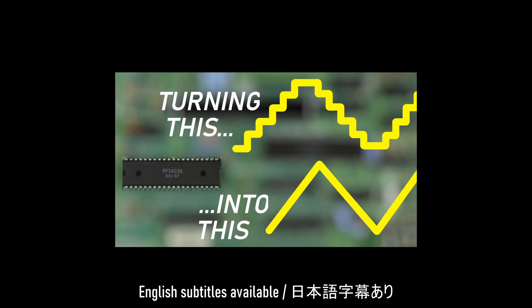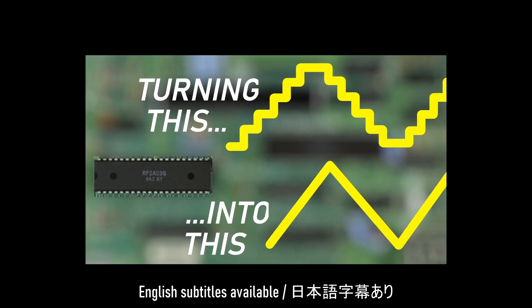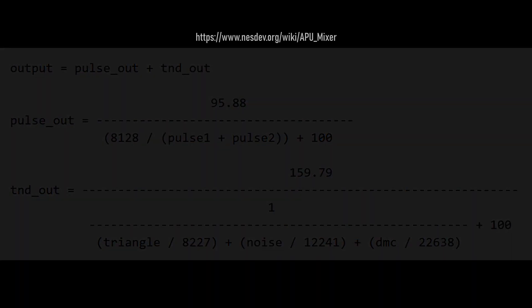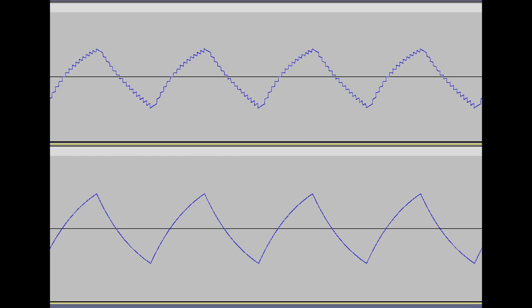In a previous video, we tried to create an idealized NES sound chip by altering how it generates sound waves. We tried to have each channel mix linearly, so that the volume of a channel will not be affected by the volume of another channel. This was important because the triangle and noise channels are often affected whenever a sample is playing on the DPCM channel. Besides this, we also made it so that the triangle wave generates a smooth waveform without steps, much like how the Commodore C64's sound chip generates it.